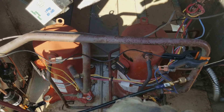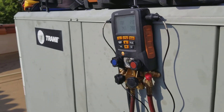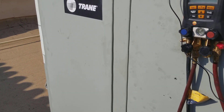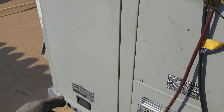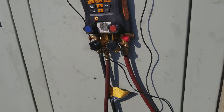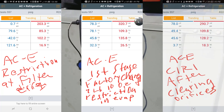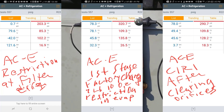But if this probably wasn't a good compressor it'd be dead already — but it's got good compression and it's running now. So far I've had 100% success doing that orifice trick of using the torch to heat them up really hot, pretty much cherry red but not melting them, and then blowing nitrogen through it — cycling nitrogen as you're getting those all hot, and blowing it out, opening real close to that like I did. And it worked. I will put up on screen the readings before the filter change, then after I changed the filter dryer, and then the reading for what it is now — new filter dryer and having the orifices cleared. That's just kick ass. It works. Try it.